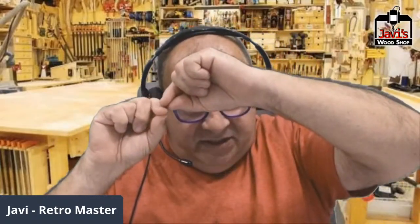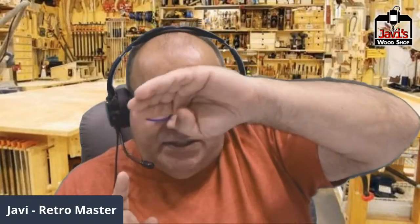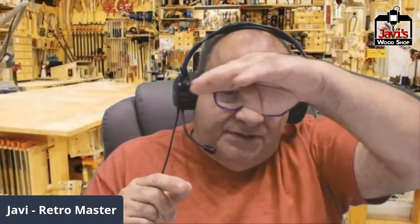But if you focus, it'll actually zoom up and then zoom down a little bit. On the curve of the arc, because it's creating one arc, not a bunch of points, it's actually going faster on the curve and then slowing down when it gets near the points. If the point is smooth, then it's barely going to slow down at all, because it's going to be a continuous thing. If you do an arc like this and then it goes back, then it's going to slow down completely. And if you don't choose arcs, depending on the machine and the G code being produced, you may end up getting something very slow in transition. Again, the arcs are more efficient if you have this thing designed this way. And with that, that's pretty much it.